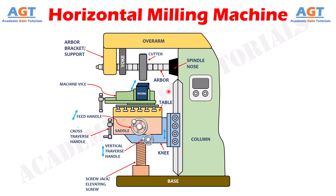Third, the table can travel longitudinally in a horizontal plane using the feed handle, allowing the table and workpiece to be moved side to side. This sideway horizontal motion helps to adjust the workpiece at the required position along the x-axis for material removal. The machine vise mounted on the table can be loosened or tightened using its handle. The machine vise has two jaws — one movable jaw and one fixed jaw. By rotating the handle, the movable jaw can be adjusted left or right while the other jaw remains fixed, allowing workpieces of any dimension to be held.